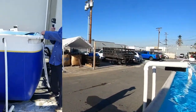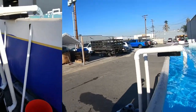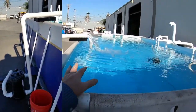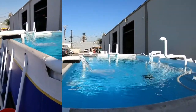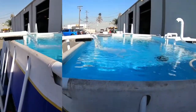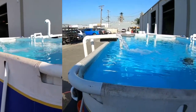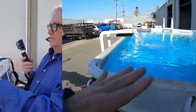There's a benefit to turning your pool over multiple times. The idea that you'll get all the pool water into the filter with one turnover is unrealistic — you're lucky to get maybe half. Each time you run it, it's like an asymptote getting closer and closer to 100% filtration. If you ran all day in June from 6-7 in the morning to 6-7 at night, you can get the pool turned over 90-something percent.